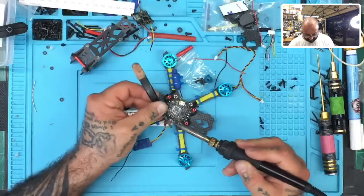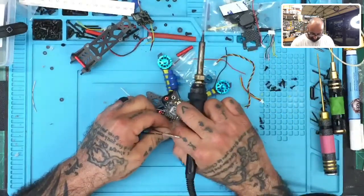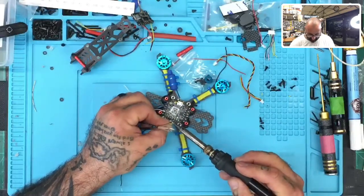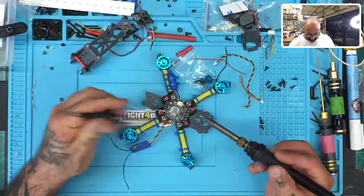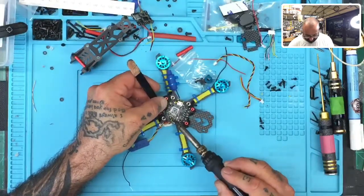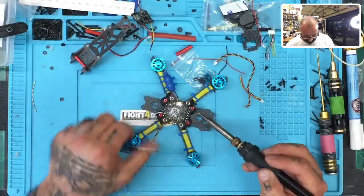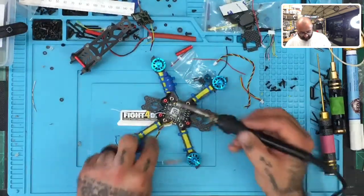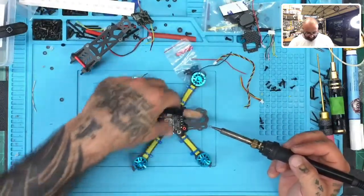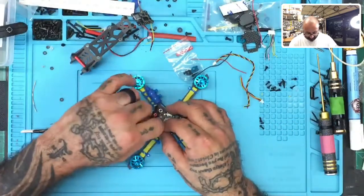And let's make sure that that wire is clean. That doesn't look very clean. Looks like the strands are spread apart there. So let's clean that up a little bit. Perfect. And we're going to put that on the S bus section right there. Okay. All right, now, ideally you could have come from the inside and done it so the wires wouldn't be exposed on the frame, but these are going to be very minimally exposed, so I'm not too worried about it.